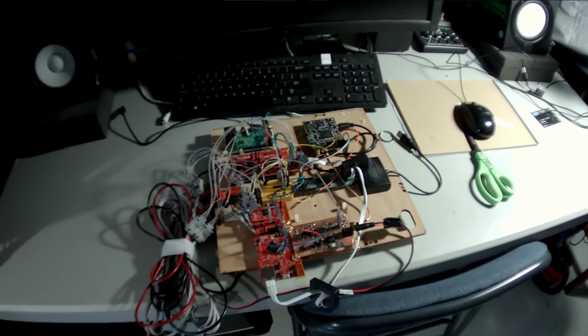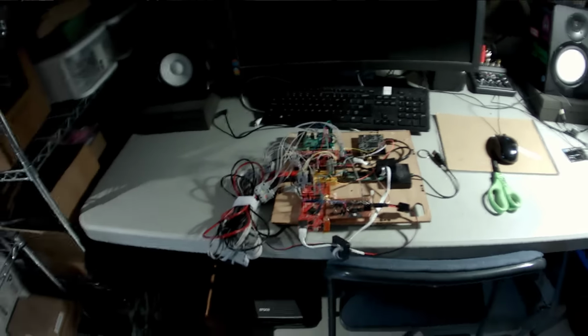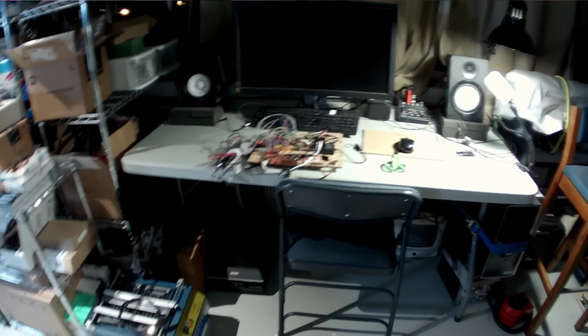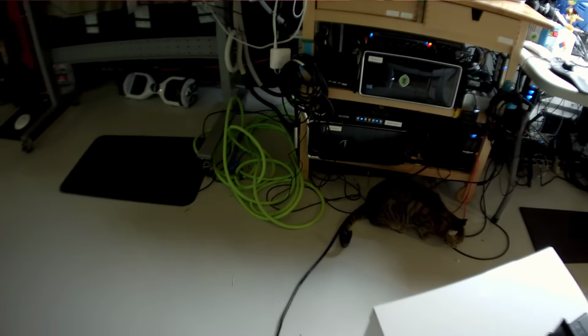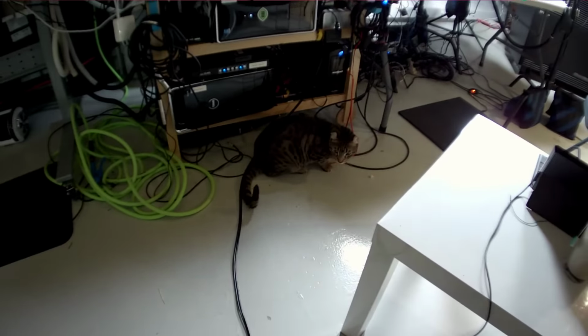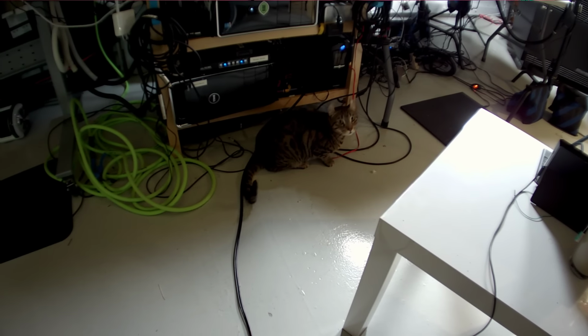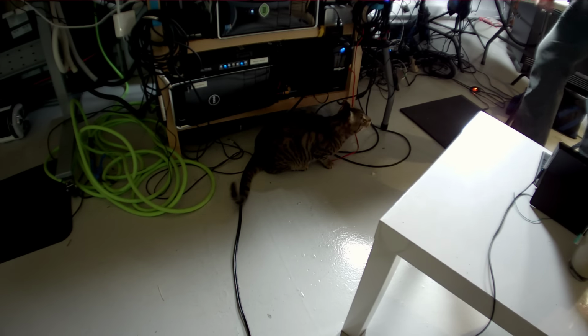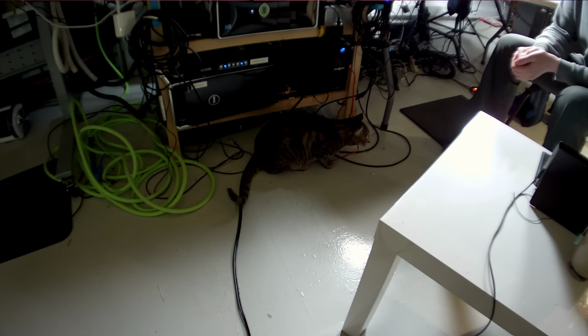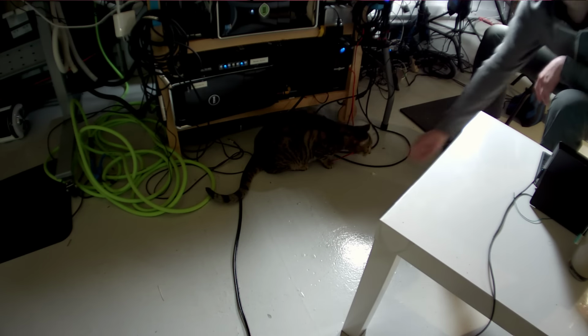which is actually at a pretty interesting point. Some of you might have tuned into some streams previously where I'd been sort of playing whack-a-mole with electrical issues on that. And I think I got that to the point where I could pretty reliably get the processor into one of two states upon starting up. Either I could successfully use a voltage glitch to break out of a loop, which is the particular test I was trying at that point, or, maybe about half the time, the processor would just totally fail to bring up Ethernet entirely.